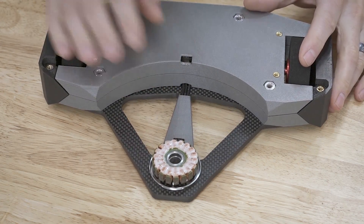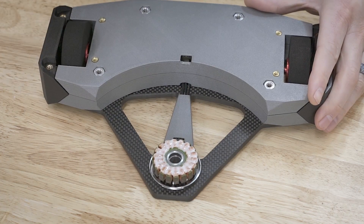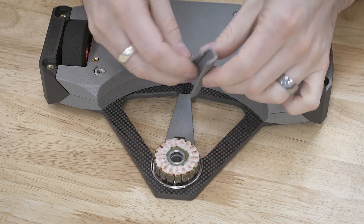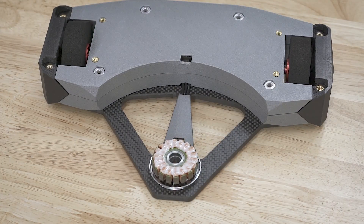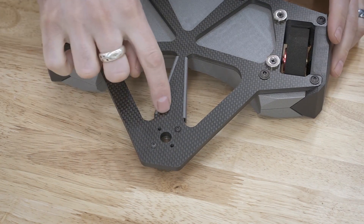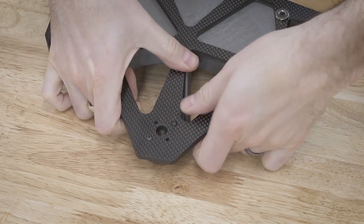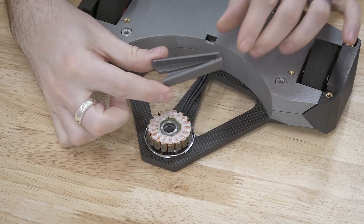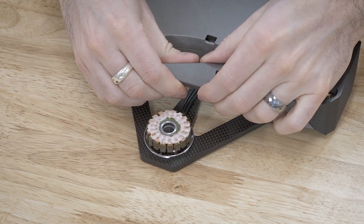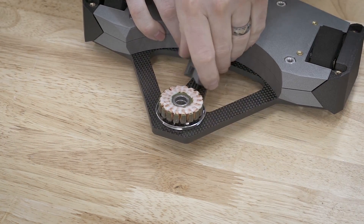I wanted to share one last little modification I made kind of last minute — one night I had this idea. I didn't feel totally comfortable just taping and zip-tying the wire, so I 3D printed this little cover out of nylon G. It has a channel down the middle for the wires and a radius to the top, with little clips that clip into the channels and cover the majority of the wire. It is really, really on there — takes quite a bit of force to remove. I printed it vertically so the layer lines run along the bend direction, so it shouldn't snap. It's just a nice little cable clamp to keep these wires from getting nicked or hit.